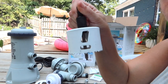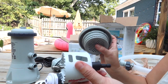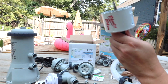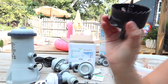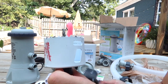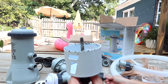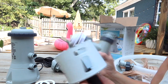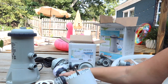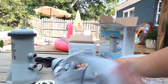This is the hole saw I used for this top piece — this is too small for the other piece. So you either can use this one on top and the bigger hole saw on bottom, or you can use this on both and just be careful on top. This size is two and a half inches; this one is two and three-fourths inches. So it's only a little bit different but it is helpful. That is the size you'll want to get for this piece. Now I will no longer be talking about this piece — I'm going to use specifically Intex pieces for the installation.